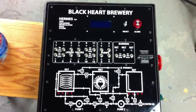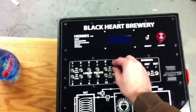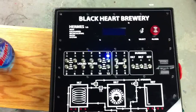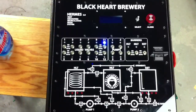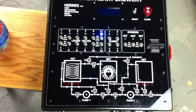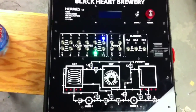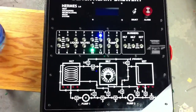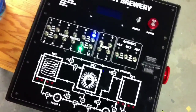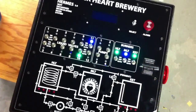We finished soldering up some of the switches and LEDs and just want to give you a quick demo. If you switch down, it's going to turn the LED blue and put it into automatic mode, which lets the microcontroller take control of the valve. If you switch up, that turns on the valve immediately and turns it green. There's no LED when it's off. So for instance, we could turn on a burner or set one to auto.